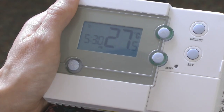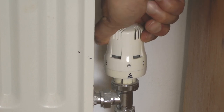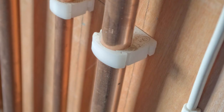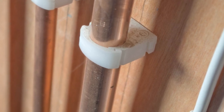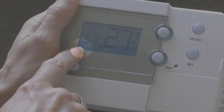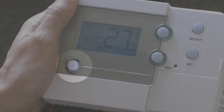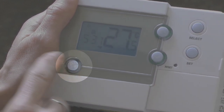The other button on the front has two functions. One is to light the display — press it once and the display will light up for five seconds. The other is frost protection mode. This overrides the program's settings and means the heating will only come on if the home temperature is as low as just five degrees, enough to stop water pipes freezing, and is used when no one's going to be in the home for a while. To activate this you need to keep your finger pressed on it until the snowflake symbol appears. To turn it off, press and hold it for three seconds. The display will revert back to normal and the programmer will keep running according to the times and temperatures you've previously set.